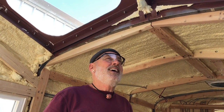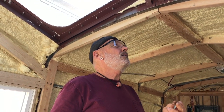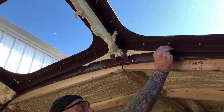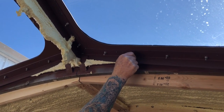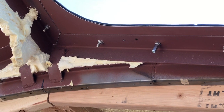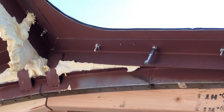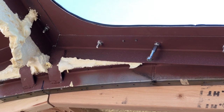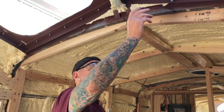What we've come up with is using these connector nuts — it's a long deep nut. We've got the studs that come through from the sheet metal work we did, and we can screw the connector nut on there, push the insulation up, and then put a nut back through this way to anchor that insulation up there where we can't connect to the wood frame.